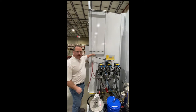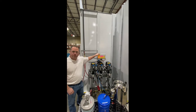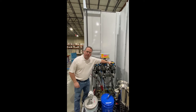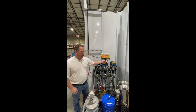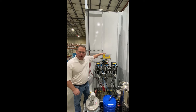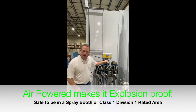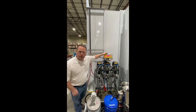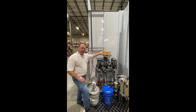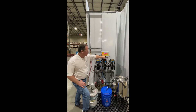The operation of the system — you come in on a Monday morning and you're going to turn the main air on. This is the Wagner Twin Control 2840 pumps. We have one for the A component, one for the base, and one for the catalyst. This is a simple on-off to the pump. This is an air-driven turbine that powers the brain of the two-component system, so the only connection to this is air. When I turn the air on, it spins the turbine and provides a low-voltage 12-volt signal. This powers up. In operation mode, the painter only has the ability to do three functions: spray, stop, or flush.